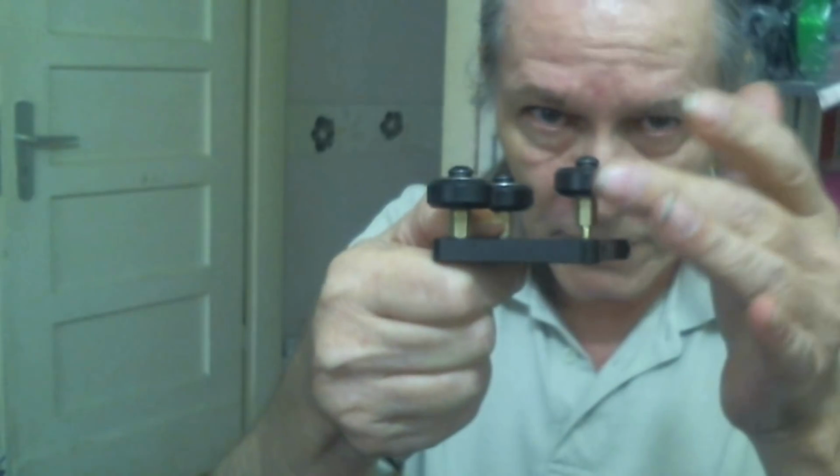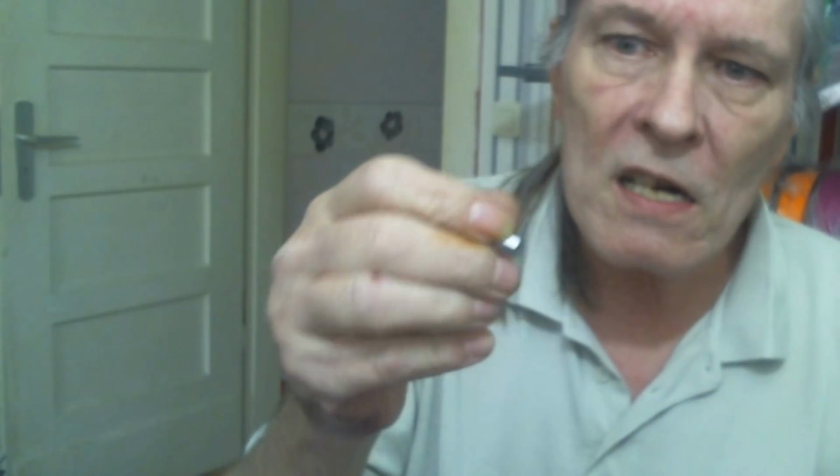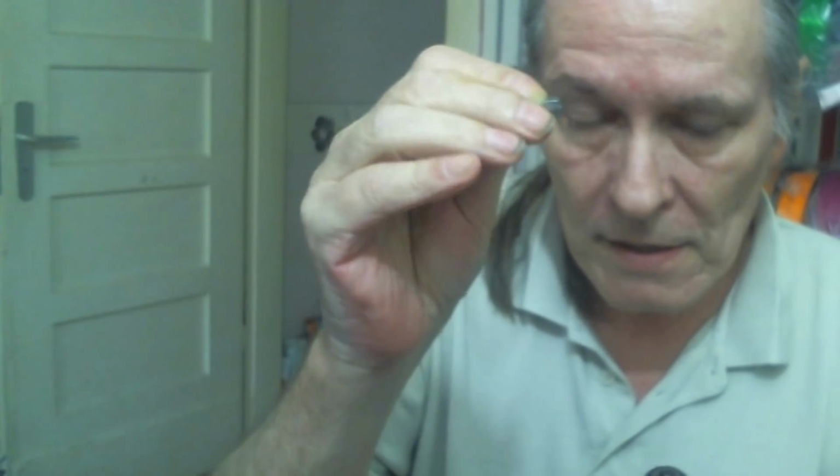the old screws that were holding the wheels here, they are 8 millimeter, and the new ones, which I have on right now, they are 10.1 millimeter. And when I mount this thing back together, that means that the bed will be 2 millimeters higher, which means I should not have any problem anymore with the bed frame hitting the stop switch.